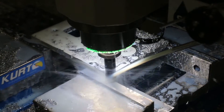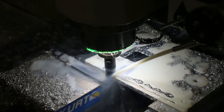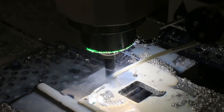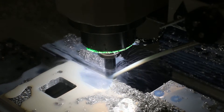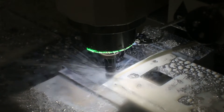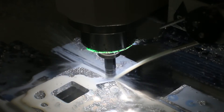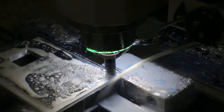Switching to the Tormach shear hog — this only lasts a little while because this thing throws coolant around and gets too much on the camera lens. You can see it went back to setting based on tool length, and there's a wiggle built into the code. Because the cutter height is so short, that answers the previous question — it's using the height of the cutting surface, not the full stick-out. It's doing a great job, but we have the same issue as with the superfly where it drops off the edge — we can't compensate for that since we can't move side to side.